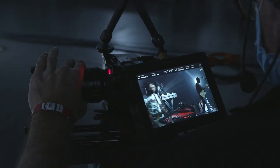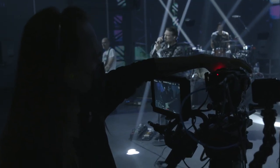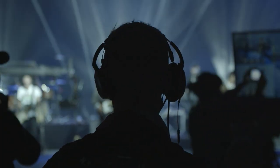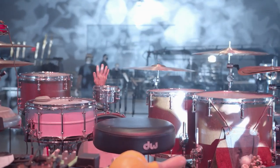What's unique about these cameras is you can use them like your standard cinema camera or ENG style camera. They have SDI out, HDMI out. But what's also really cool is you can put in an Ethernet cable and use power over Ethernet and control over Ethernet, so you can have a whole array of cameras all networked into one base station, and one person can control all the functionality of the cameras. Because it's all power over Ethernet, there are not a lot of limitations to where you could put them — they could literally go anywhere. You can hide them and mount them in a corner, on a car for a car shoot, or hide them in the drums or behind the keys.